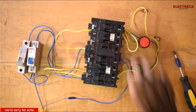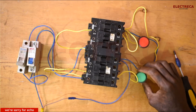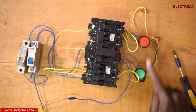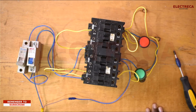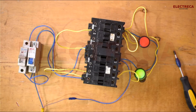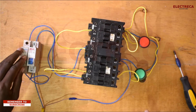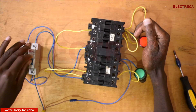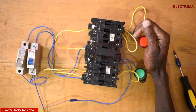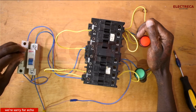Now let's put these connections together and test this to see how much this can really protect us. Each contactor has got a light. We want to see: if one contactor is running and we try to run the other, will it come on? Let's begin with the first one. Contactor PC is running and the light is glowing. Now let's see contactor MC — contactor MC is running. Now, let's see if this contactor can really come in at the same time.